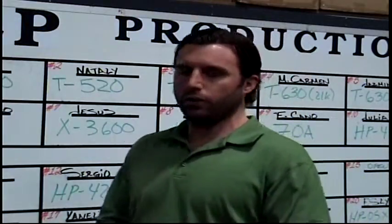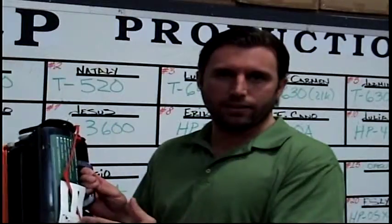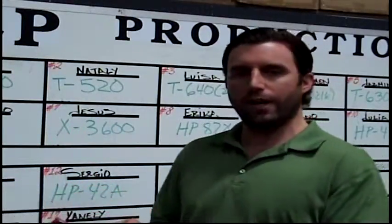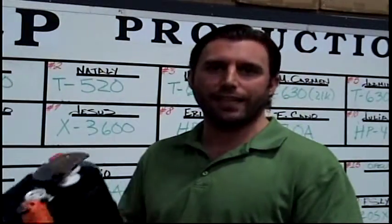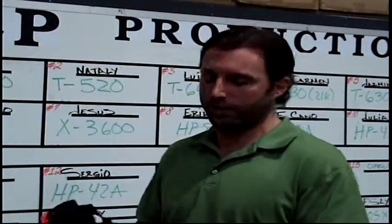The 2nd kind of cartridge is a split cartridge. What that basically means is that there's a cut made into the hopper to clean it out before it's resold. And the issues you have there is that it has to be glued and stapled back, and you typically have a lot of leakage. What we do here that's different is we use a non-split process.